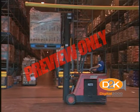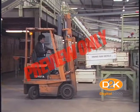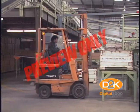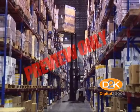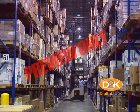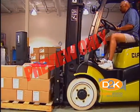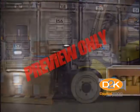Extreme care shall be used when tilting the load forward or backward, particularly when high tiering. Tilting forward with load engaging means elevated shall be prohibited except to pick up a load. An elevated load shall not be tilted forward except when the load is in a deposit position over a rack or stack. When stacking or tiering, only enough backward tilt to stabilize the load shall be used.